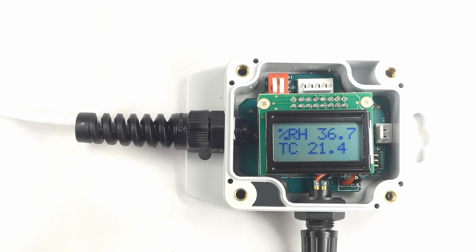And the final point I want to mention is that although the HDR200 can read up to 200 degrees C, it must be a non-condensing environment, since condensation can damage the sensor. However, if you have a condensing environment, IO-Thrifty may have a solution for you. Please contact us and we'll be happy to discuss your application. Thank you for watching this video.